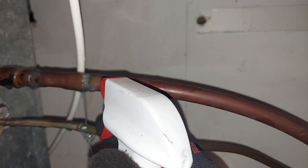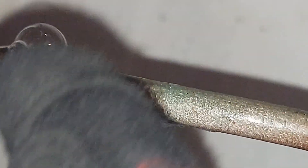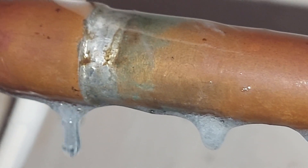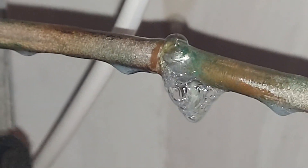With standing pressure, the low side is exposed to higher pressures. When it was running it was only at about 56 PSI - now the pressures will equalize. Up top is still good, and it's leaking even while it's off at standing pressure - in the bottom. I hope there are no other leaks. Once I fix this I'll pressurize with nitrogen and see if it holds.